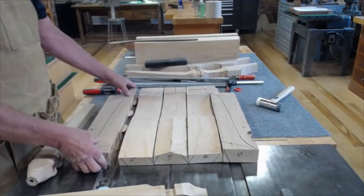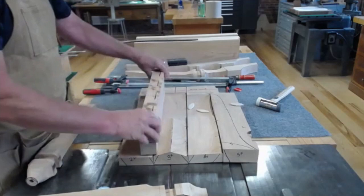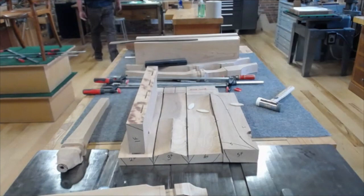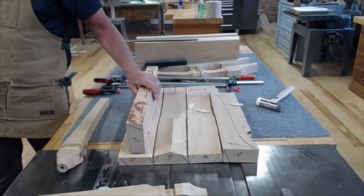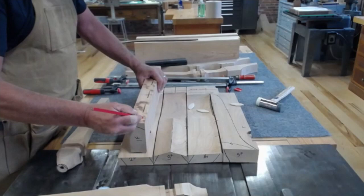When you're making these 3-degree angle cuts, I use a table saw. Now, there are folks out in the world that use a jointer and put their fence at 3 degrees and joint it that way, and that's certainly a good way to do that. I've done that before. I've had more success with my table saw than with my jointer. Although this is a newer jointer to me, I haven't tried it with that. And I have a 16-inch jointer as well, and for some reason the fence doesn't hold 3 degrees all that well. So I was struggling with getting 3 degrees throughout the whole thing.